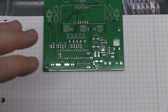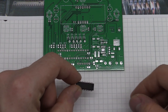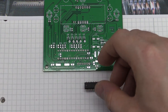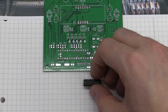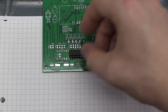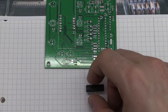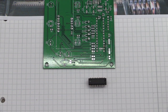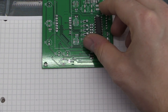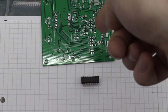So of course, if that was it, it would be quite simple, but we have some challenges with the pick and place machine, because imagine your part is here when you need to pick it up and you need to place it here. In this case, I used a through hole part because it's bigger and easier to show, but it would be SMD obviously. If you take it and put it here, it's pretty easy, you can fit it. But if your board is like this and your part is like this, it ain't gonna fit. So you need to be able to rotate your part once you pick it up. So the Z axis has to be rotating, or the nozzle has to be able to rotate.